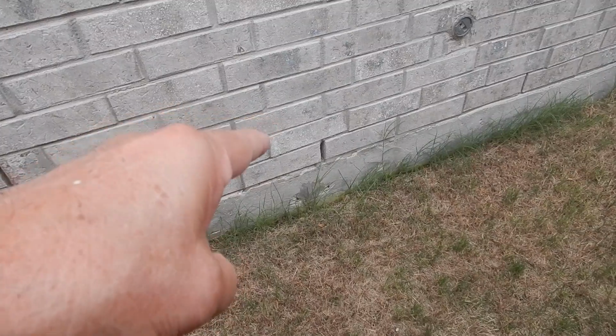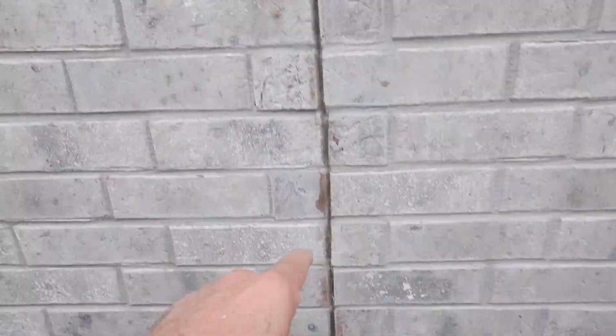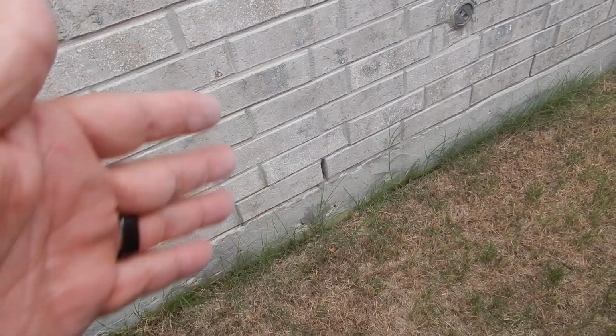But just because these are necessary, this is not an elongated weep hole. Now, this is a control joint. It has a completely different use. And these weep holes are designed to handle as much water as gets behind the walls. This is adding water that was not anticipated, was not designed for, did not meet the design criteria.